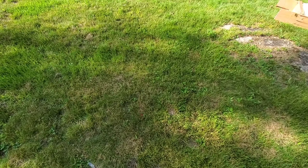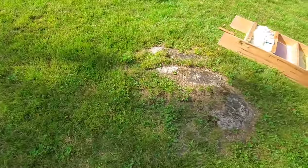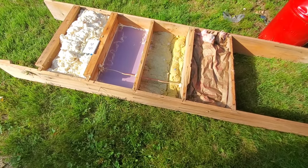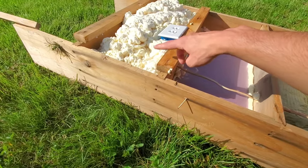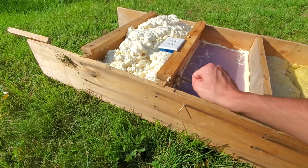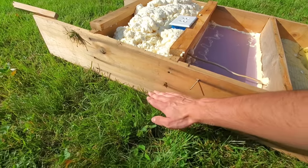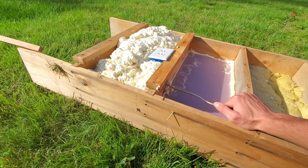This weekend I went to Home Depot. I wanted to build a full scale 8-foot tall wall for this demonstration, but lumber is so expensive — they wanted $16 for each stud. It would have been a $500 project. So I found this old bookcase to do a little demonstration on. I didn't actually fire up a spray gun — that's just the Great Stuff, which is a mix. When it hardens, it's a mixture of both, and by code that would probably need about 4 inches. It expanded a lot, but in the real world you just shave it off to make it perfect for sheet rocking.